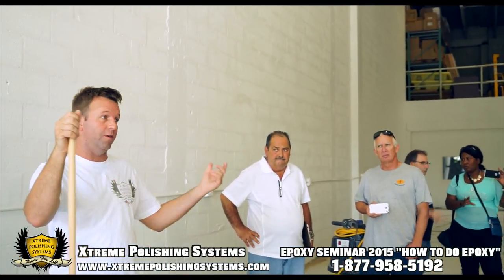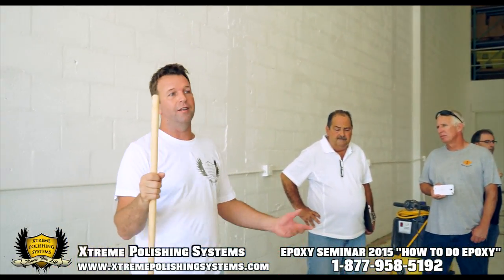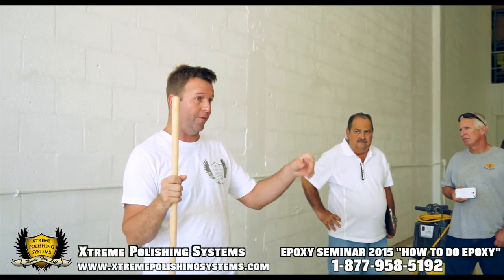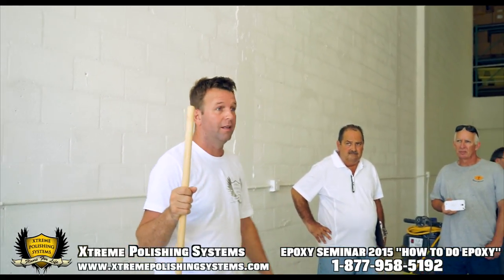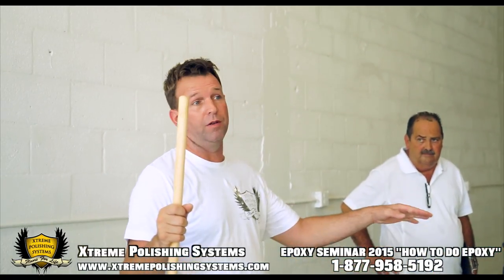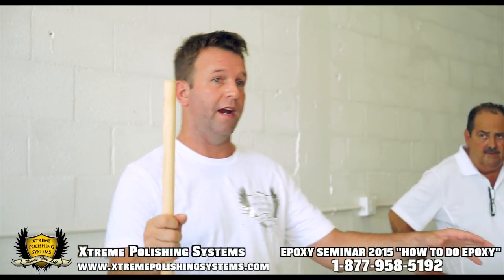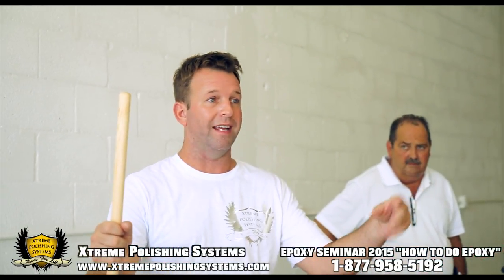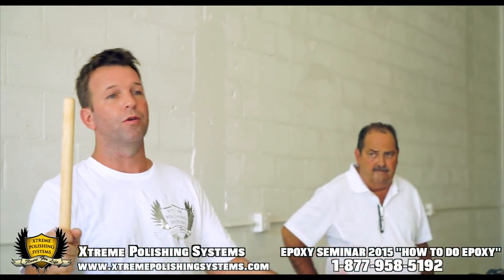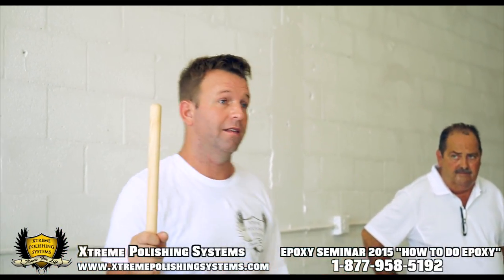And then you throw your flake, you throw whatever. Otherwise, if you're doing a standard, which would be your light, like a gray color with a light flake, like the Home Depot looking kits, you would do a prime coat of a color, let it dry, then come back and do another color, gray, whatever, tan, and then throw your light flake in that. And then your optional clear coat would be your polyaspartic urethane. It depends how you sell it.